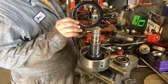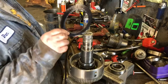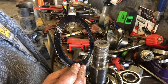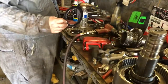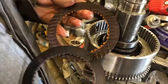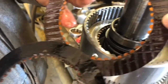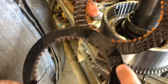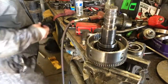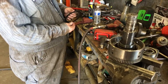I took a pause on the time lapse here because we're working on the clutch that pulled off. As you can see, if I zoom in a little bit, there's no paper, no texture left on the frictions. It's had too much water in the oil and all of the friction material is gone. This one here has a little bit of texture left on it on the upper side, but down here there's nothing left. So this winch wasn't pulling — he was having trouble getting full turns and wasn't getting the full line pull he was supposed to.